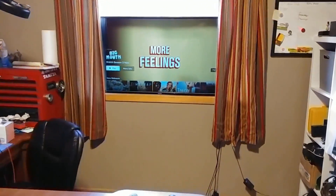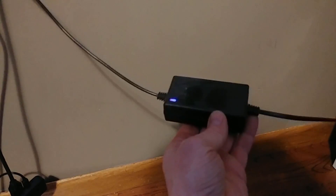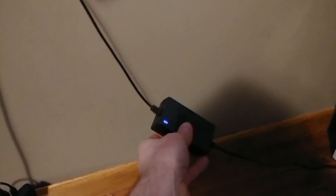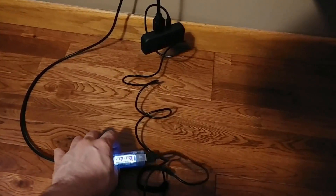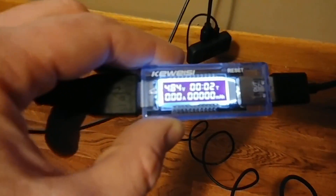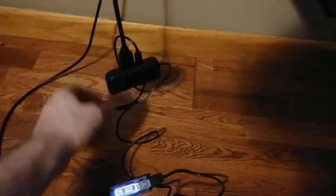What about indoor use? Here I have it running just off of a general purpose 12-volt AC adapter. Even a simple 10-watt wall wart would be enough — the TV only consumes 7 watts. And on top of that it's running a Roku, so now it's a smart TV. The Roku is getting power right off the main board USB port and it's drawing such little power it's not even registering. So this would have no problem running off the solar panel also — as long as you have a Wi-Fi signal, you have TV.